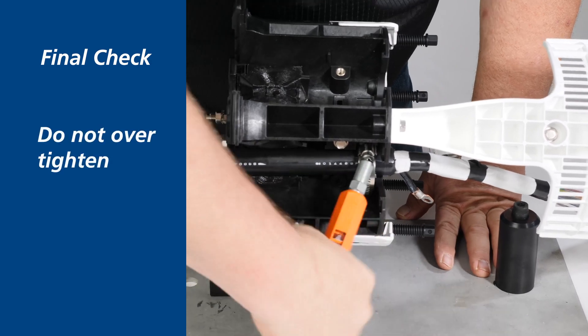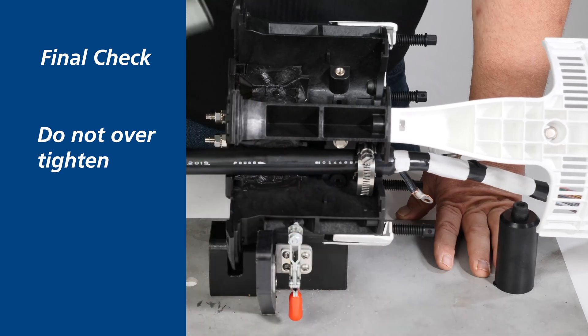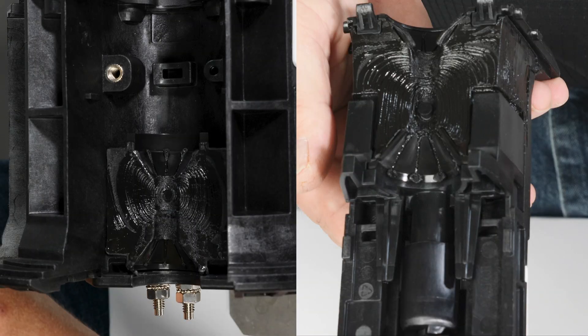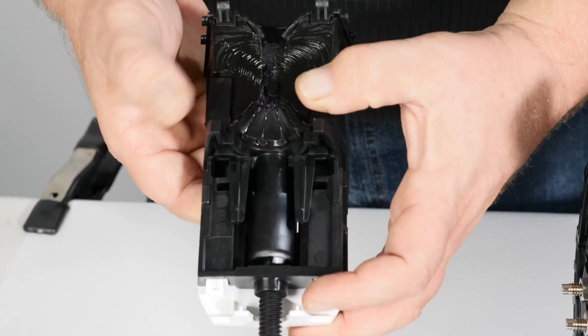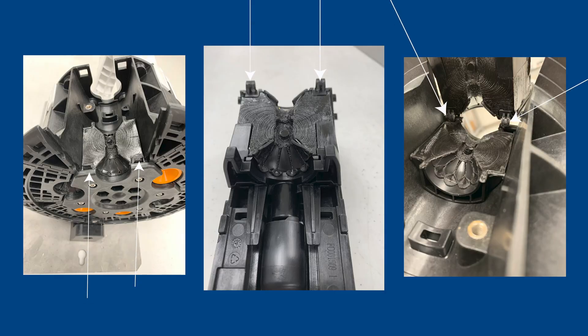Be careful not to over-tighten as it may damage the fiber or cause temporary attenuation. Once the cable attachment unit and the hose clamp are secured, inspect the cable attachment unit to ensure it is completely seated. Make sure both base gel and sealing wedge gel are clean and free of contaminants. Depress the base gel and elongate the sealing gel as shown, each time installing a sealing wedge. The Apex closure has sealing wedge engagement pins and wedge base mounting locations.